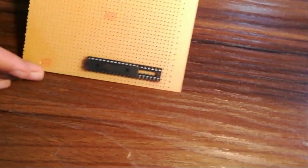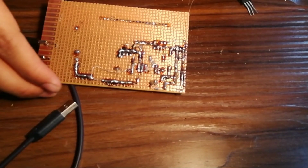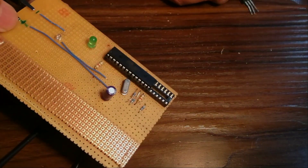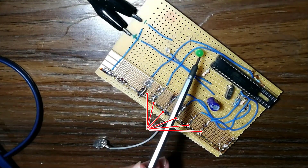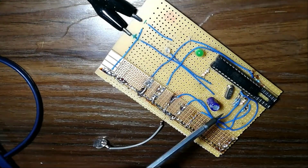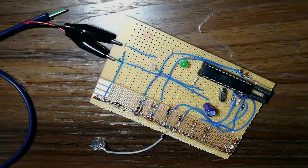As I got satisfied with the results, I moved to soldering. I gathered all the necessary components and after 3 hours of soldering the project is 90% complete. I soldered single strands of copper wire to the THD board which are going to act as momentary switches. I also added a 25V 100 microfarad capacitor in parallel to the power supply to smooth out any fluctuations, and the remote is completed.